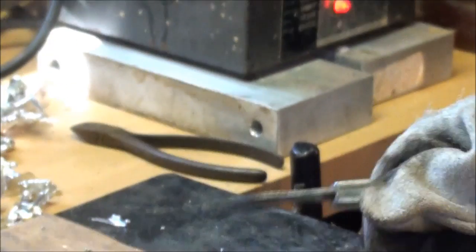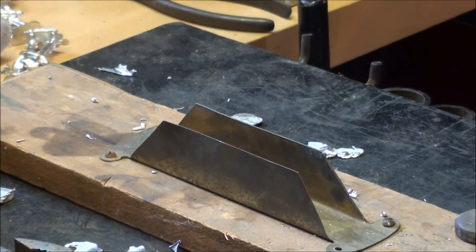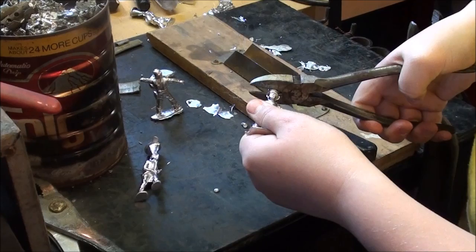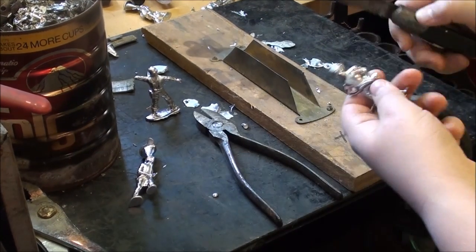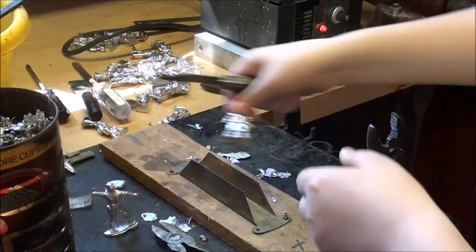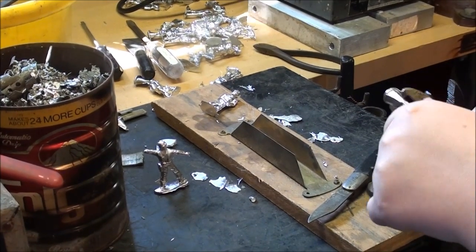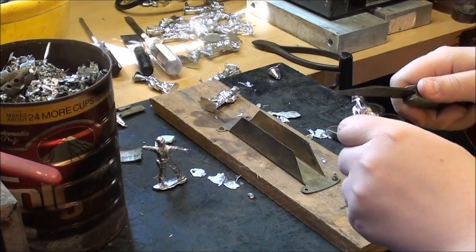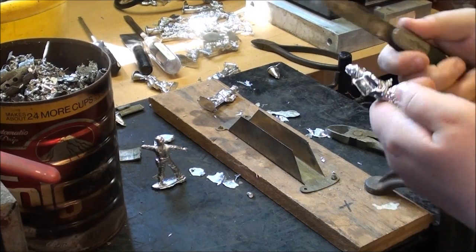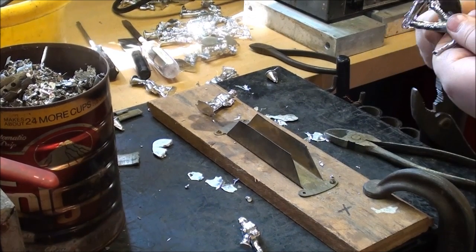We're going to wait for it to heat up a little hotter. In the meantime Jordan's cleaning the mold. If we weren't doing that, we'd take the time to cut off the sprue and gate from the top of the head. We've got a few soldiers here from the other day. Jordan took his gloves off because they're cold — he's using side cutters to cut that top off and remelt it. Then if necessary you can scrape off any extra flashing. Here's one I've already done — a little flashing there means the mold isn't quite all the way closed.